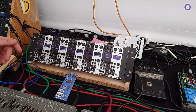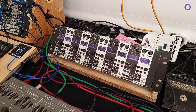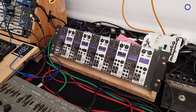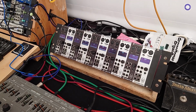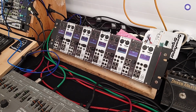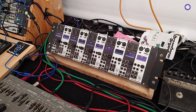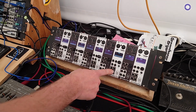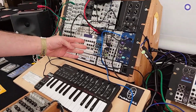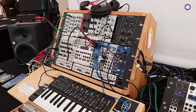You have these tuning modules too. Yeah, it's a microtune module. It's actually a MIDI to CV, CV to MIDI, and quantizer, and clock generator, and you can load scales from the SD card. You can work microtonally. You can also edit the scales. You can use it to distribute MIDI, CV, clock all over your rack. And that works in two channels with the main module, but we also have expanders, so you can add up to 8 channels total. And you can select which functions are happening.